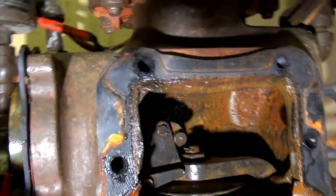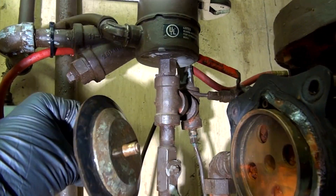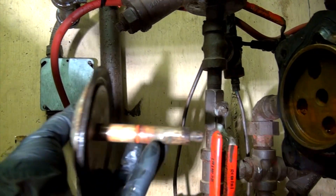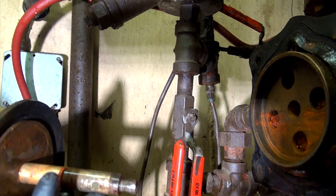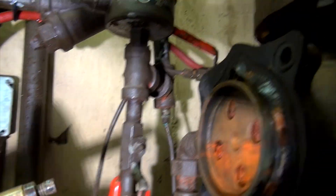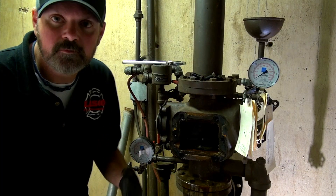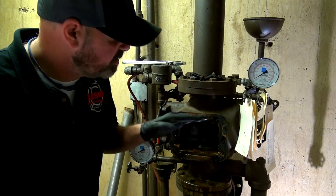All you've got to do now is work on your side plunger. Right here is your side plunger, and what we're going to do is slide it into this hole right here. There is a rubber — a little O-ring right there. You want to inspect that O-ring: make sure everything is good, no cracks, not stretched out, it's in good shape. We're going to slide our side plunger in like so. We have our clapper seat set and our side plunger in. Now let's get some covers on this thing and get some air on.